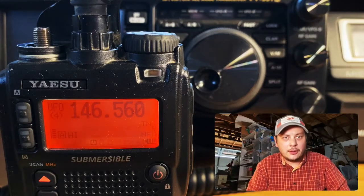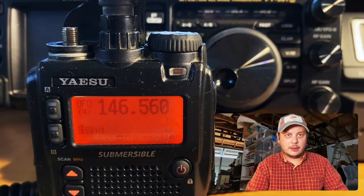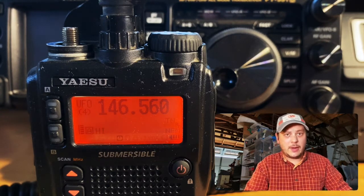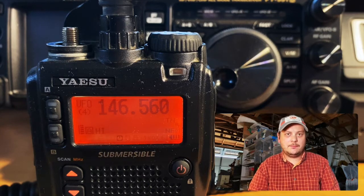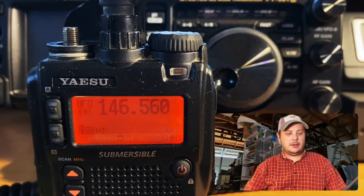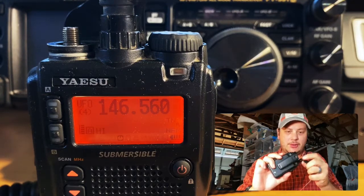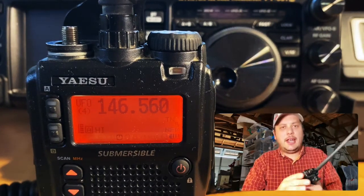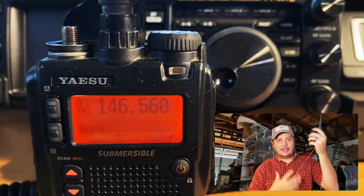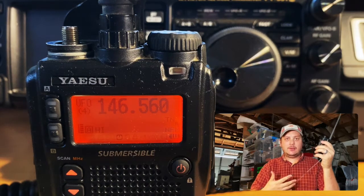I'm going to demonstrate this for you now — I'm going to switch to the double camera. As you can see, I've got my VX8 and I'm using this radio because it has an attenuator built in so I can do this test in close proximity. I've taken the antenna off to attenuate even further, otherwise the incoming signal strength will be too high, and I'm going to transmit with and without the Ziptenna to show the performance increase. This is just a simple test at three-tenths of a watt with the stock ducky antenna on. The Ziptenna attaches just to the regular lanyard connection point on the back of your radio and it drapes down behind your radio — your hand goes over it. The Ziptenna has a quick release, which will allow me to hold the radio in exactly the same position and connect and disconnect the Ziptenna periodically to show the performance difference.